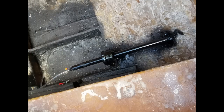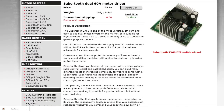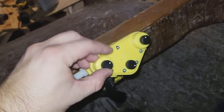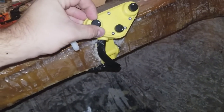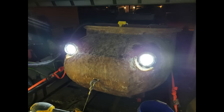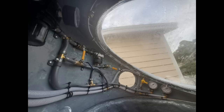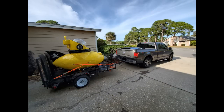After that, I mounted two 12-volt trolling motors to either end, and sealed up the pass-throughs with flex seal. To drive the motors, I used a dual 60-amp brushed speed controller made by Dimension Engineering. The control signal was a simple 0-to-5-volt analog input from a potentiometer. From here on, most work involved electrical wiring and painting. And here's what the final product looked like mounted on its trailer, connected to my truck. At this point, it was ready for its first test.